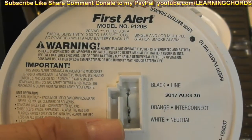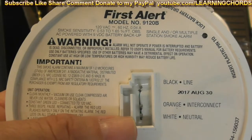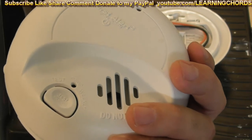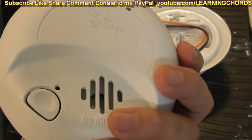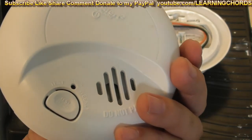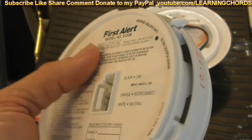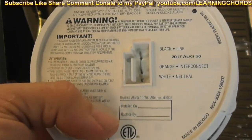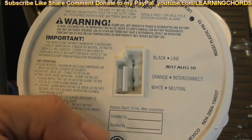This thing triggered. I'm assuming it triggered because I used a shop vacuum and blew a lot of dust around — they come with a little cover and I didn't cover it up. It was doing a little chirp chirp chirp, which usually means a dead battery, but I checked it with a voltmeter and the battery was brand new a couple years in. I'm assuming it was the dust. I could reset it, but for about $15 I just bought a new one. These are supposed to last about 10 years and they really don't, but they're so inexpensive it's whatever.